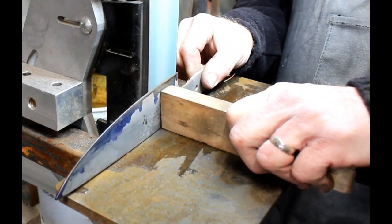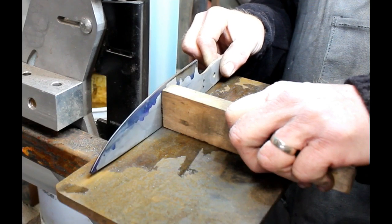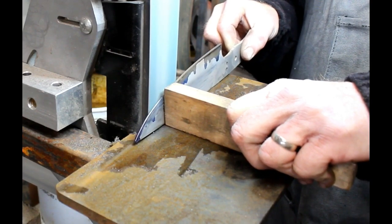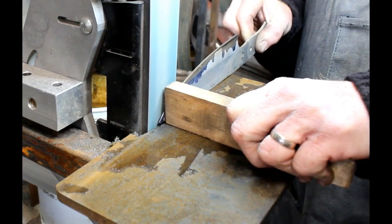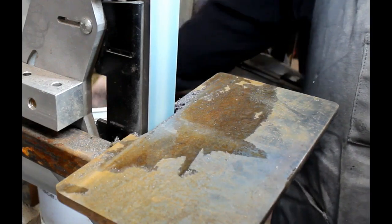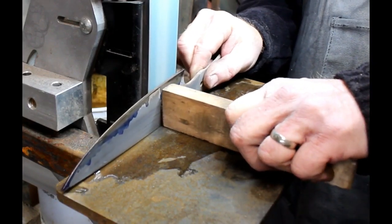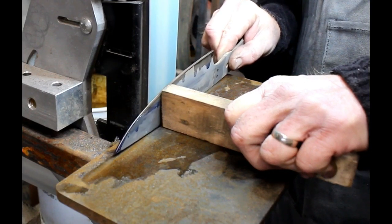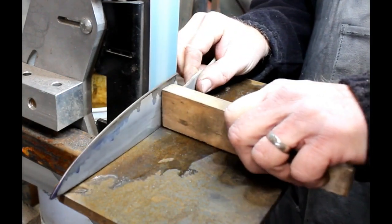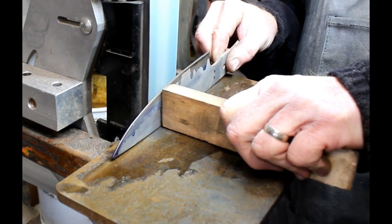I can visually see the scribed lines on the edge of the blade, and I can also see where I ground to when I broke that 90 degree edge. From there on, all I'm doing is chasing that bevel line upward until it's almost even with the flat of the blade. I'm doing this in real time on this video — I don't want you to miss any of it, and you'll get a better idea of how long it takes. With this method, I do each side in about two minutes. This is the rough grinding.